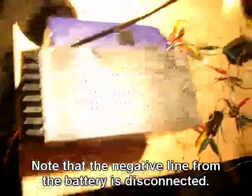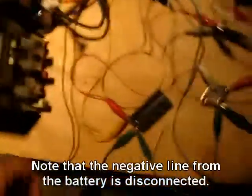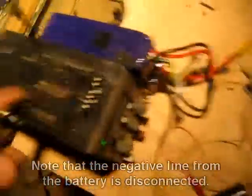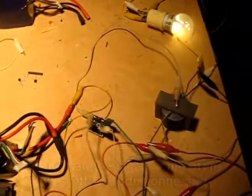I'm going to flip the light back on here and see the configuration again. The battery packs are just resting here, and again the power supply is turned off. Turned on — it makes a little difference when it's off or on, and that's probably because of the transformer in the power supply coming on and providing a little more signal. But turned off, completely off, and it's still oscillating.